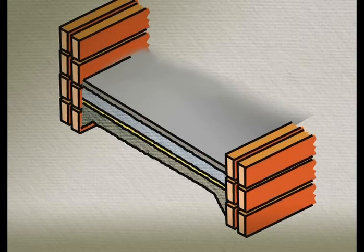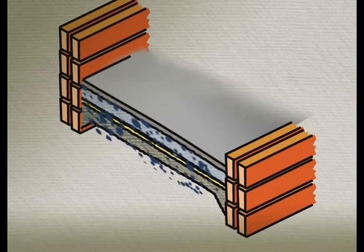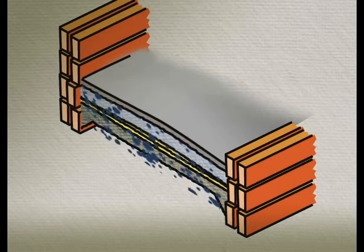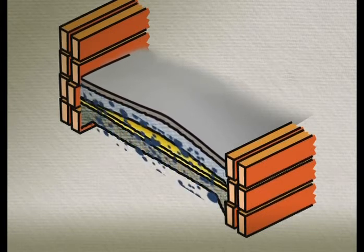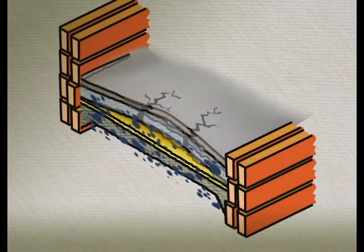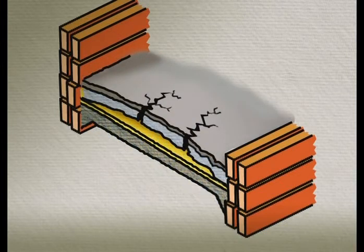At a microscopic level, these crystals are growing, but on a macro level or a large-scale level, concrete will expand and crack, and you can actually physically see cracking of concrete if it's been damaged. If it's in a floor slab that's restrained laterally by walls or by foundations, the concrete slab may actually dome due to the expansion. So is there any way of preventing this, and particularly if it's waterborne?